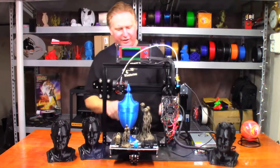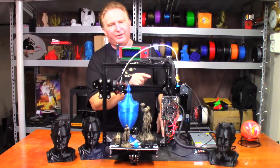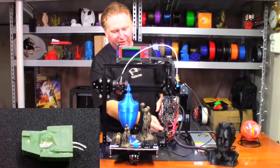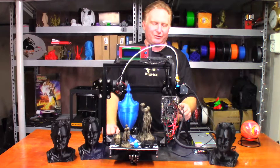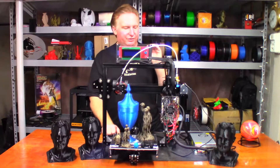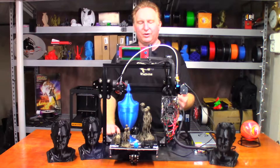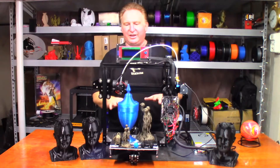The PEI sheet held it just fine. Once the bracket was finished printing, I installed the external MOSFET and then desoldered the connector for the heated bed, drilled it out a little bit, got everything cleaned up, and re-soldered the wires going directly to the MOSFET. That went without a hitch. While I was at it, I also found an issue with the power wires because they started sparking too.